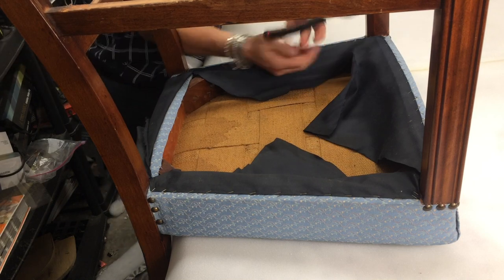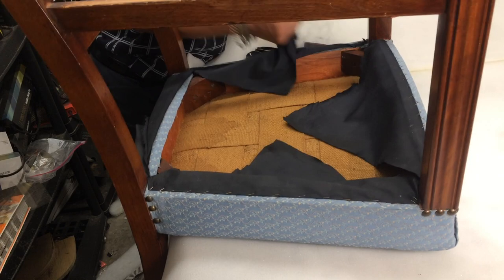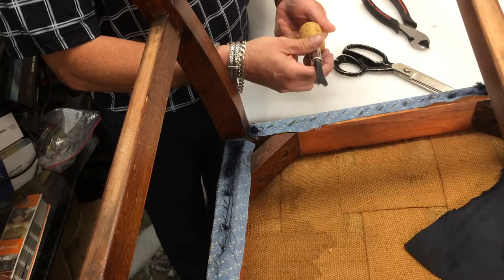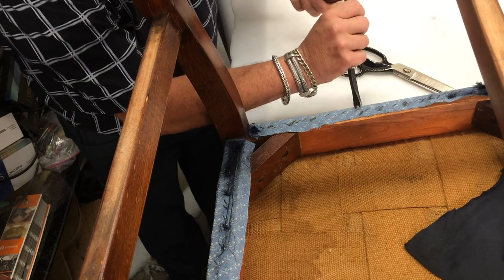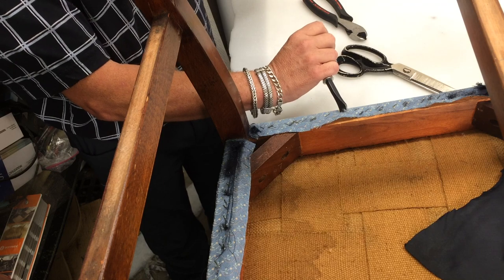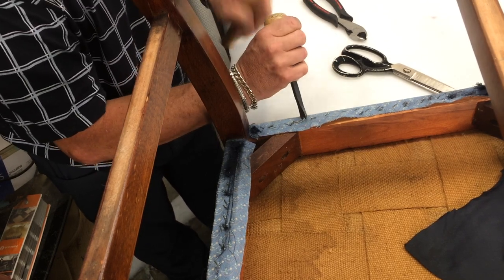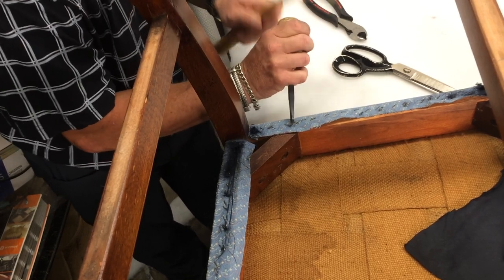And then I just take a pair of side cutters like this, and I just start to pull off the dust cover like so. And this is just a standard staple puller to take staples out. You can buy it from Canadian Tire, and I just go ahead along like this. I do it this way, a little bit easier, but if you're not that good with a smaller tool, you can have a hammer or something that works good enough, and you just proceed like this, and I just continue going along until I get all the staples up a little bit out of the wood.